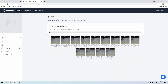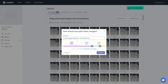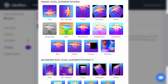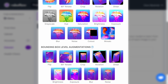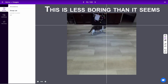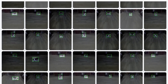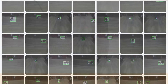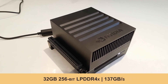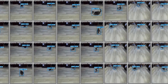The first thing we have to do is train that network. I recorded a quick video of me playing with Henry with a laser pointer, pulled out individual frames, and uploaded them to RoboFlow. I'm using RoboFlow to automatically split the data into training and validation sets, and also using its built-in augmentation tool. Augmentation takes your existing images and creates new versions with slight differences like different exposure or added noise — basically a free way to get more training data. I manually drew a box around Henry in each image. With all the augmented data, there are almost 1,700 images for training. I used the Jetson AGX to do the training — it's more than powerful enough, but also very low power and fairly quiet, so it's easy to run at home. Once trained, the network does a really solid job of picking Henry out.